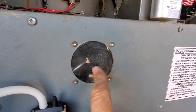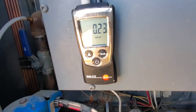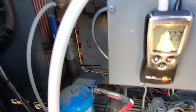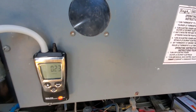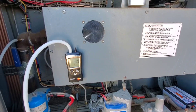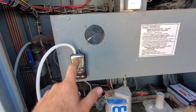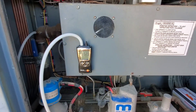We're up and running — it's hard to see through there but we can see the burner all fired up. I tried to clean the glass as best I could but it needs replacing. We are at 0.24 inches water column. This is a modulating gas valve — it modulates up and down to feed the correct amount of gas to the burner to bring the air up to the right temperature. We have it set for around 70°F; it tries to maintain 70°F discharge air after the cooling coil going to the lab downstairs. Burner's changed and running — I'll go check the discharge air at the computer as my last step and we're done.